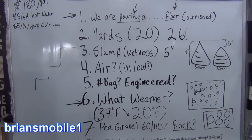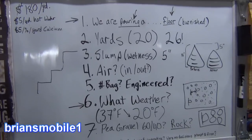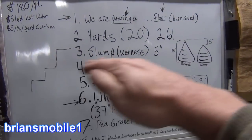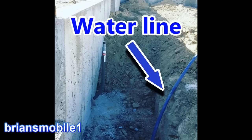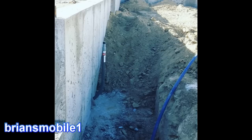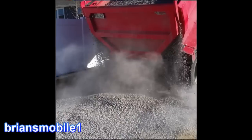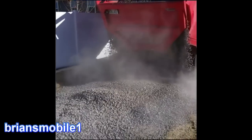Now that we know all of this stuff, let's look at some fancy power tools of the trade for doing concrete and some techniques for making the floor really nice and flat. You have to get your utilities in before you do your floor. Anything that's going to come up through the floor — get it done, backfill it, compact it really good. Once you've compacted it, the next step is to lay down your gravel.